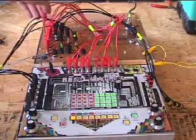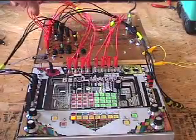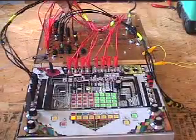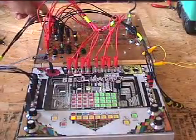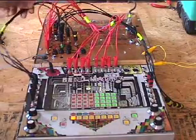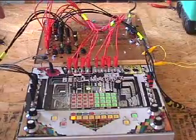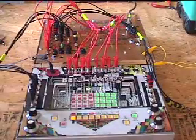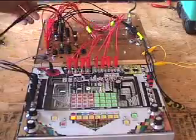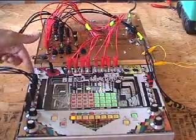What we have here in the back is a keyboard, a kid's keyboard from the thrift store, and I ran all the interesting points — the buttons — out to banana jacks. Most of these children's toys are arranged in a row-column configuration. Each button represents a row and column in a matrix, which makes it great for circuit bending with the Bend Matrix. So here, the reds are my columns and the blacks are my rows.